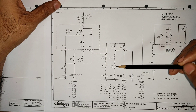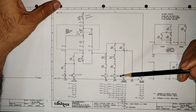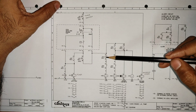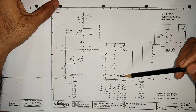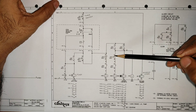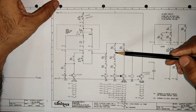Once the star coil is activated, K03 contact closes and the K02 interlock opens, breaking that line. Now with the auxiliary contact closed, the power flows to K01, the main contactor. Once K01 is energized, its auxiliary contact closes. K01 is also built-in with a timer — set at three seconds. After three seconds, the timer contact opens on the star side and closes on the delta side.